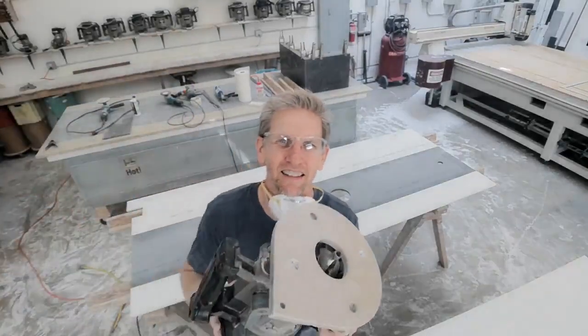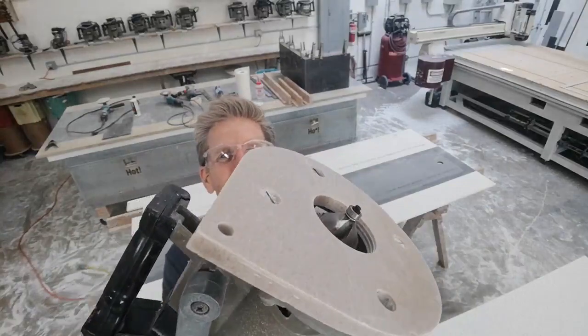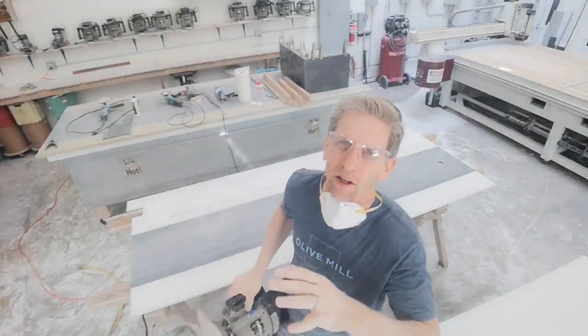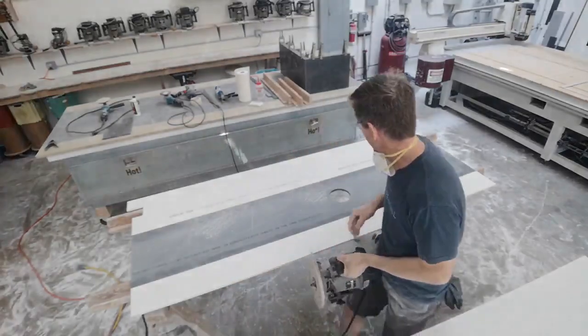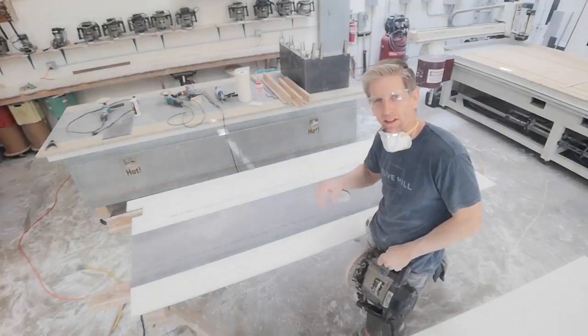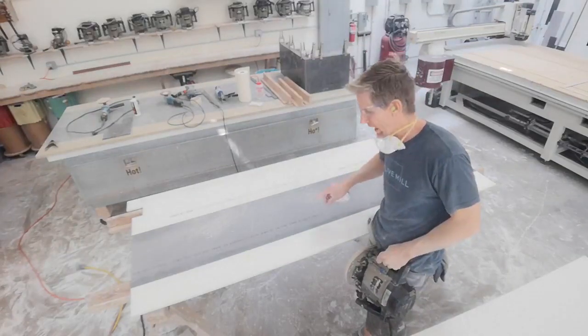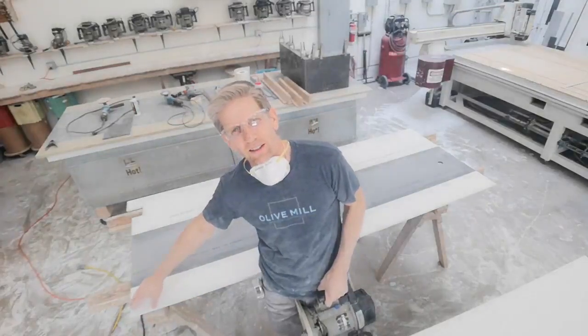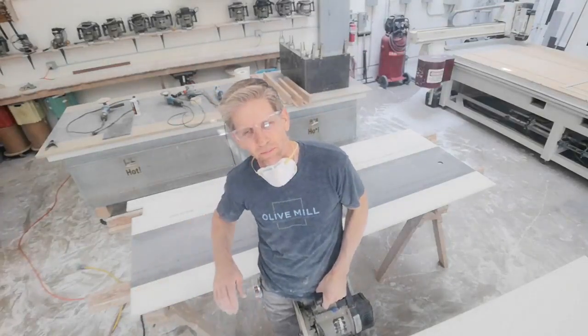All right, the next step. That's a bevel bit or 45 degree chamfer bit. And we're gonna go around the bottom, and then we're also gonna go around these openings right here, just in case there's anything on the wall that gets in the way right at those cutouts. And it makes it easier if we have to trim the bottom.